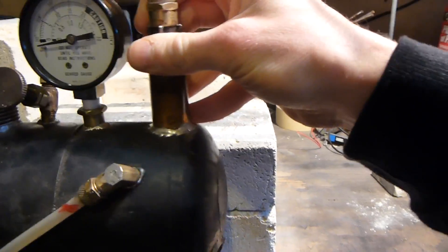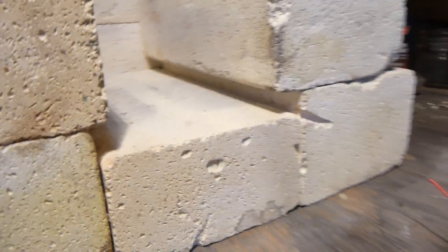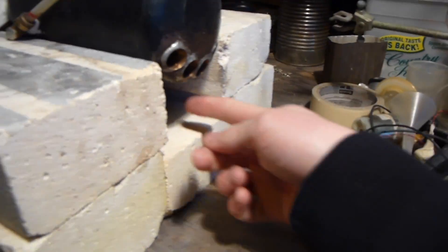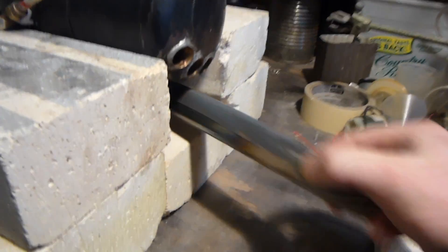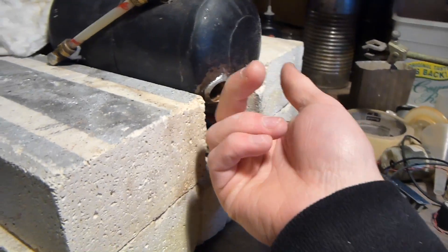I have to move these in a little bit so they overhang slightly, but it's really simple — really temporary. I want to make a much better one, but it works well for a temporary setup. Then I take this insulation and put it on that end to insulate it. The burner goes under here and the fire directly heats the bottom of the boiler, then the flue gases go over and hit this insulation.